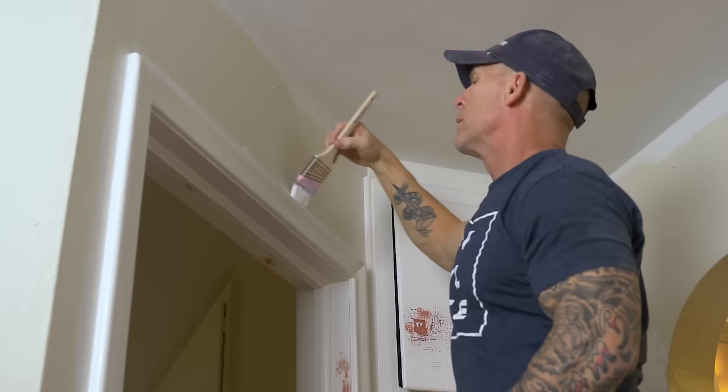We're going to remove that door, get it done, then show you the baseboards. We're hand brushing and rolling the baseboards — they're so banged up, dinged up, nicked up. We've been caulking them, Bondo-ing them, spackling them. There was carpet in here at one time and they just painted over the carpet fuzz stuck to the baseboard, so we're scraping it with a Linbide scraper. One of the advantages to brushing is it gets the paint down into the cracks and crevices, whereas spraying will just bridge the gap and not fill it.